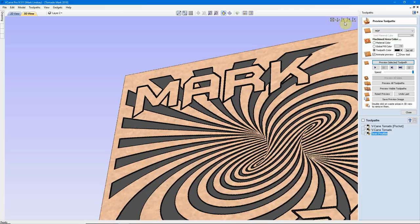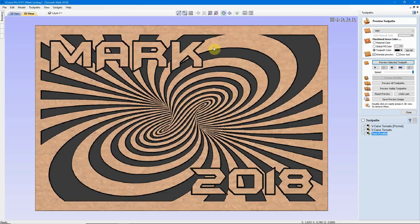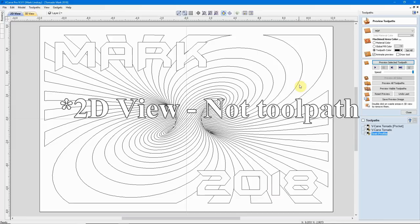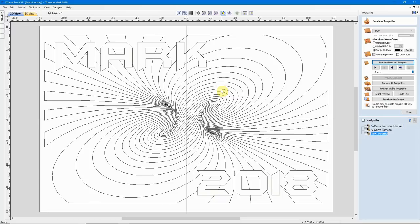What I would do with this is paint the entire thing white after it comes off the machine, and then backfill all the stripes and the outlines with black. That's all there is to it. It's simply a matter of remembering to use these layers to your advantage. When you have a difficult area where you've got vectors you had to snip away in order to make clearance for something else — before you start editing and cutting those vectors, copy them. Right-click, Copy to New Layer, then do your trimming and cutting from within those layers.